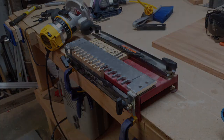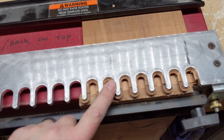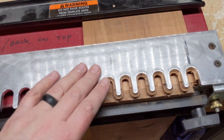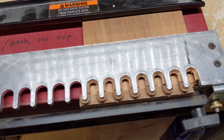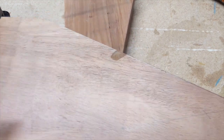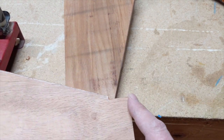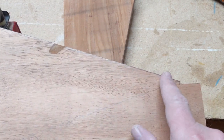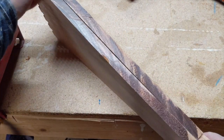I'm going to cut the two backs. I now have nice dovetails cut on both sides of the back piece. Next I have to cut the angle so I can do the dovetails on the front piece. I measured in three inches, up two and a half, over one, and then the diagonal. I cut the diagonal on the compound miter saw down to the point and then hand-sawed the rest of the way, making sure both sides match.